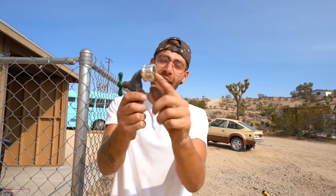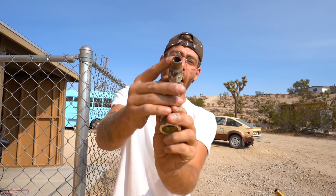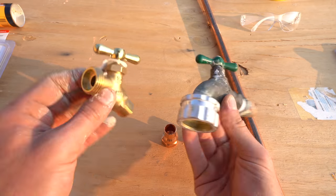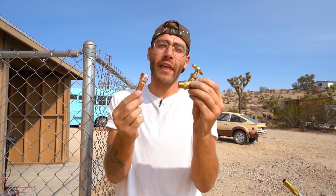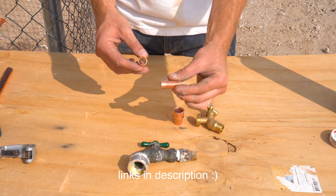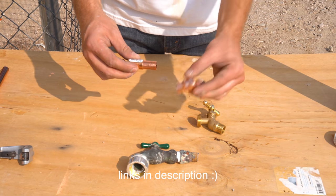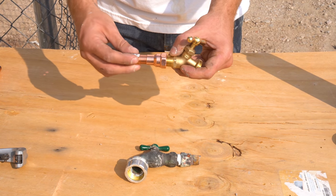So far, things could not be going better. This is our old spigot, and this is the sleeve of the garden hose — I was trying to take it off when the copper pipe behind it broke. I still can't get this off, so we've got a new spigot here, as well as a full lead-in into the wall. We're going to pre-assemble this whole thing before we install it. We've got a half-inch copper coupling with a stop, about a two-inch length of half-inch copper pipe, a female-threaded hose fitting, and a matching garden hose spigot.